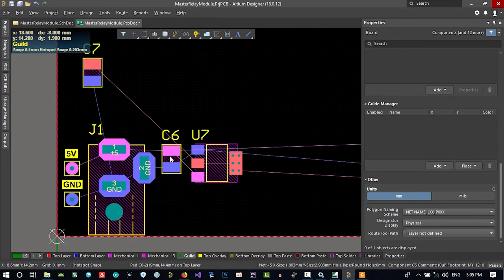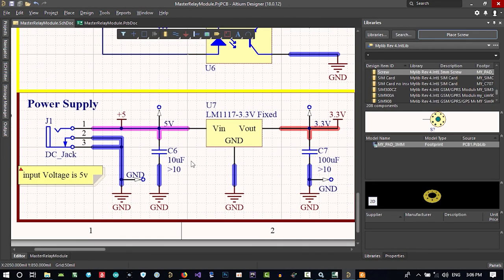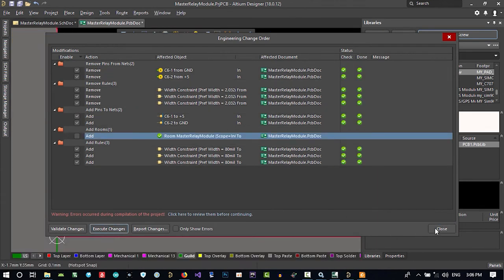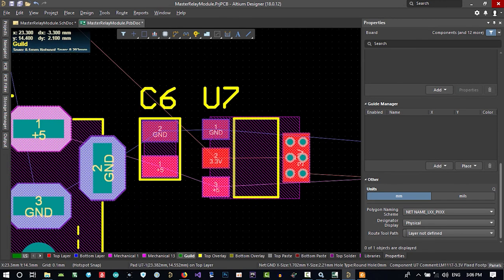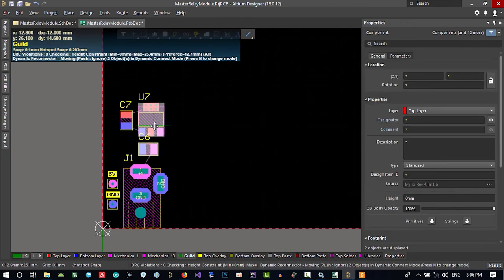You know that this kind of ceramic cap doesn't have a minus side or positive side. It doesn't have polarity. So what we can do, let's just hold control here and drag it, hit space 2 times, and again put it there. Now let's go to design and update PCB, deselect this room because we don't need it, and execute changes. You see, now this connects to here and this connects to here, and it is now so easy to connect them together. Let's just bring it back here,